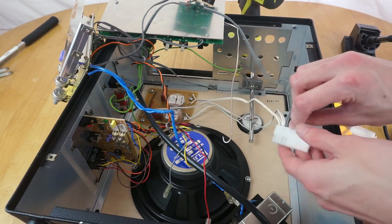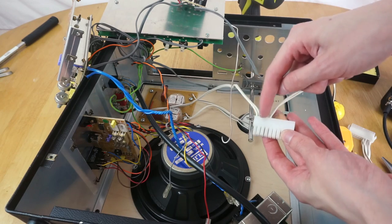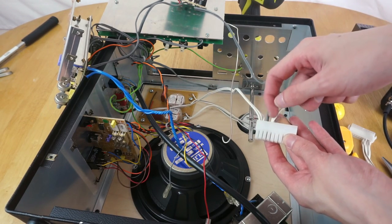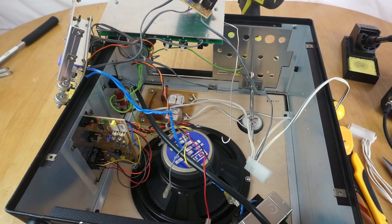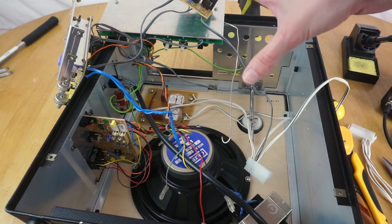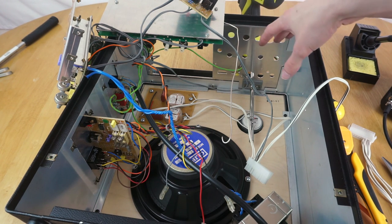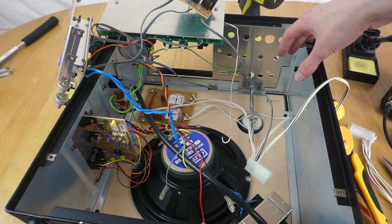And I've also now wired in this grey wire that goes up to this board here, so that's the output of the amplifier, is now also going to the speaker that goes to that switch, the connector that goes to that switch. I've also mounted the speaker in, along with the transformer, so all that's ready to go. So all I really need to put in now is remount all the amplifier and knobs and input assembly up here. And once that's done, we should be good to go.